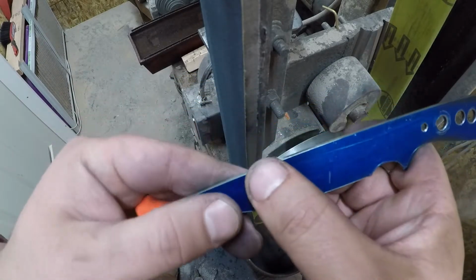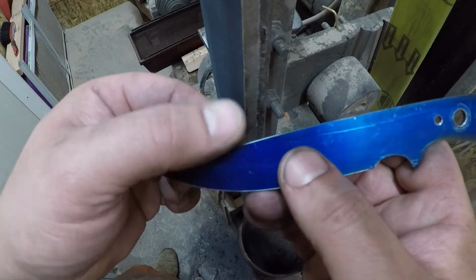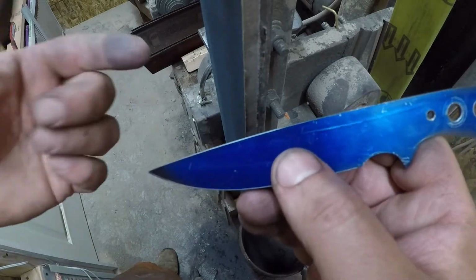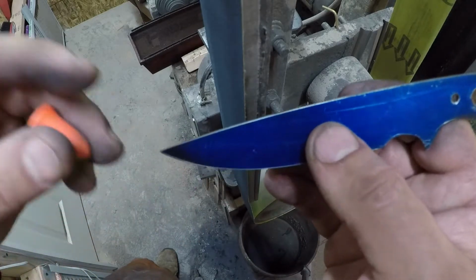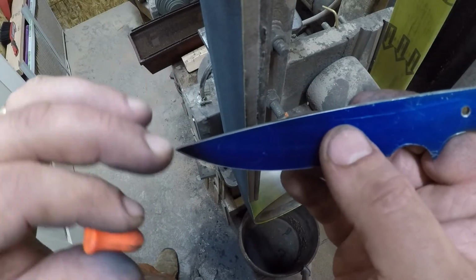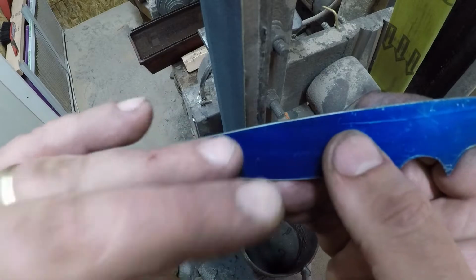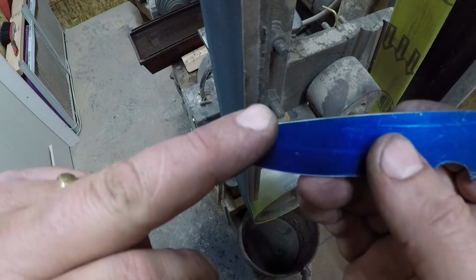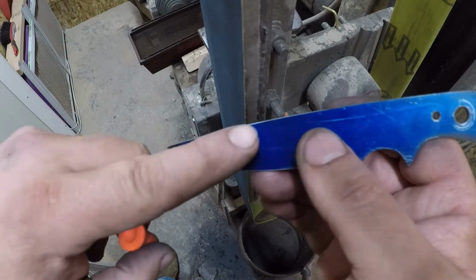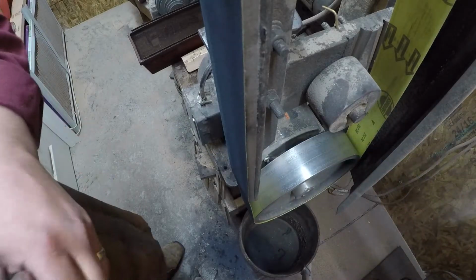Okay, and any bits of metal that aren't the main body of the blade, like these burrs right here, they'll get heated up a little bit. They won't get heated up any more than the body of the blade, because we're putting it into a kiln that's at the same temperature, right? But since they are thinner, they'll take that heat more intensely than the rest of the body of the blade, because you don't have the backup here. So a lot of times, if you have burrs like this, when you come out of the heat cycles, they'll have cooked off, for lack of a better description. So anyway, let's go ahead and go get the finger choils smoothed out.